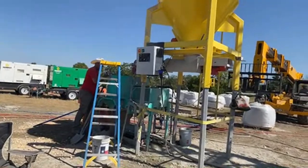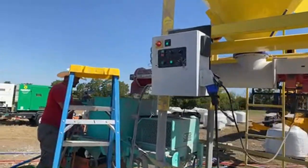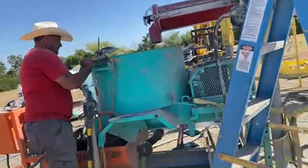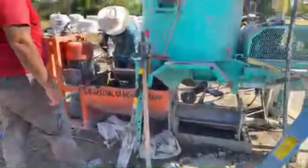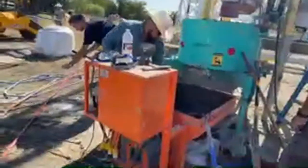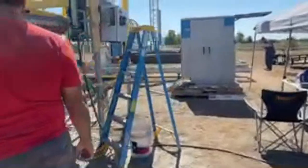And then we got the mixer pump system. So the silo, and then it has a pre-mix phase where you get a slurry, which is further processed into the blue part, and then the mixer pump system. At that point, it should be pretty homogeneous. Goes through the rotor stator into the printer. So this piece takes a bit of effort because you've got to work the material, make sure it's not all getting stuck in one corner and flowing through all the way to the end of the system. If you get some kind of break in that flow, it will ultimately affect the outcome of your print at the extruder head.